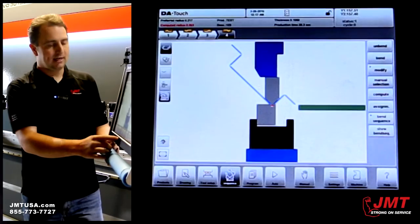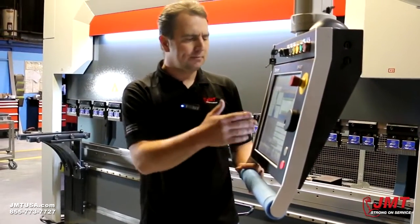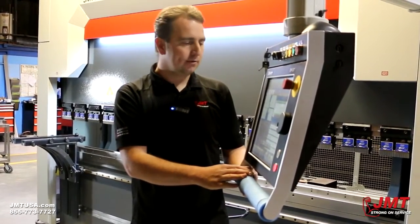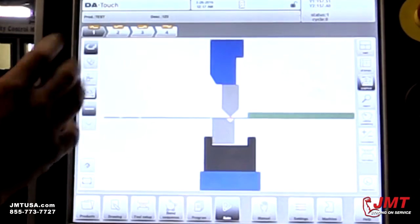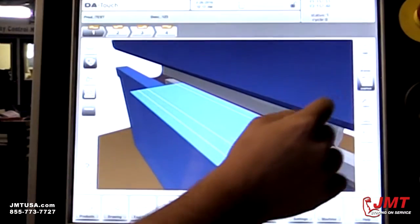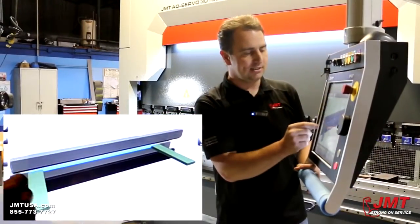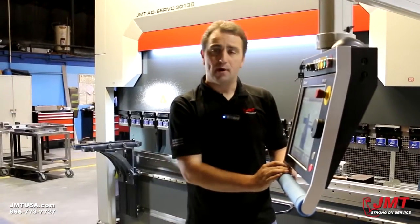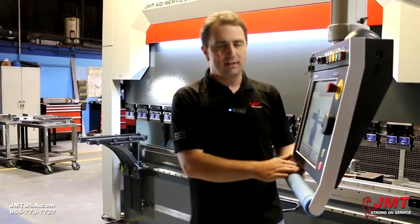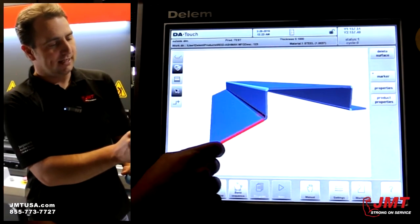From there I can simply go right into production. I go to my auto page, and it's going to prompt me to check my tools and positioning. This is the point in the control where I would bend my part and check real-world bend conditions. If I needed a correction, I can add that into the control at this time. I've also got the ability to see a 3D view of the part being bent so I can be aware of how to position it into the brake. If this is too complicated, I can remove all the framework of the machine and just go right to the tooling. This really helps new operators who may not know how to put the part in the machine — it shows you how to orient your part and get the right bends. I can also draw or program parts in 3D format.